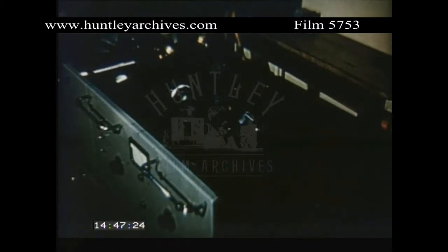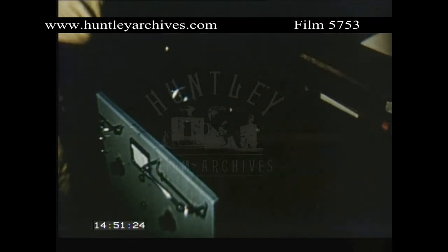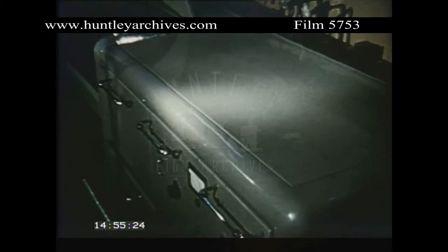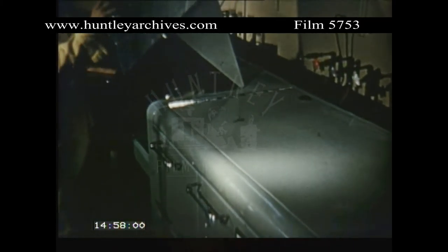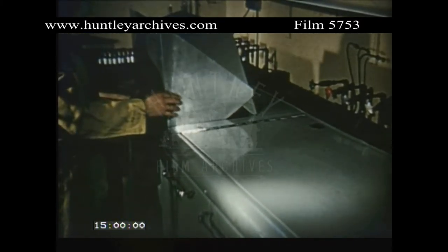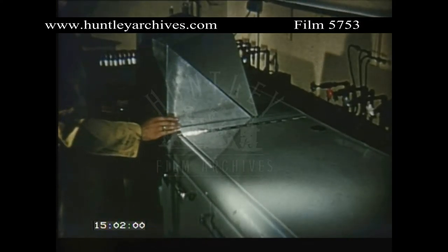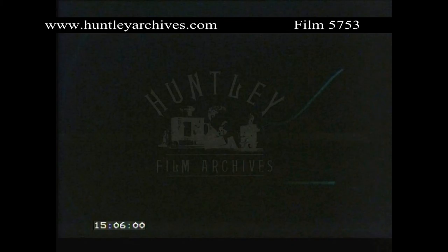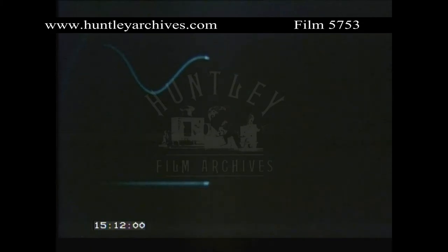This machine is linked to a petroleum pilot plant where, during experiments, the material is likely to change fairly rapidly. The sample flows through a transparent cell, and its infrared absorption spectrum is displayed on a cathode ray tube. The operator can immediately notice any change in the trace, and so keeps a check on the composition of the material at various stages of the process.